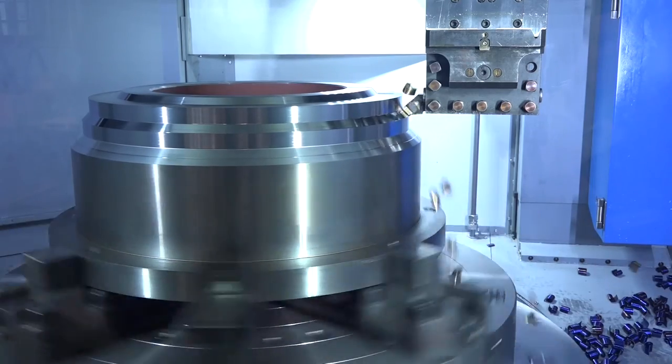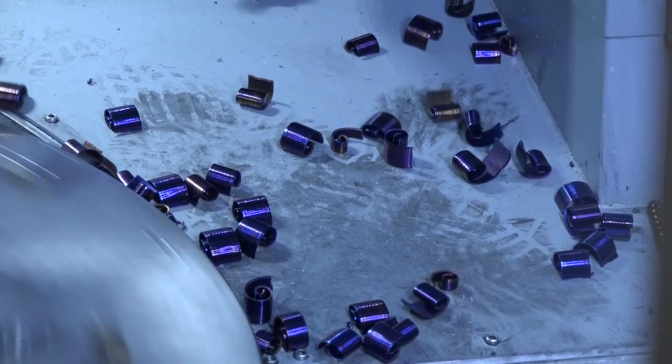You need substantial guards — you've got high-pressure coolant and a part rotating to 400 RPM. I also like the provision for the slant bed so that swarf and coolant fall away freely — sometimes vertical turning centres don't have that free-flowing angle. It's designed to move chips out of the working area. There's also a powered platform inside: it raises up during machining to let chips go straight to the chip conveyor, and powers down so you can stand inside safely for setup. Paper filtration keeps the coolant clean, and it's chilled so it doesn't affect the machine's accuracy.